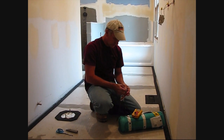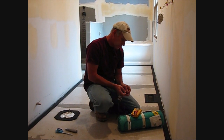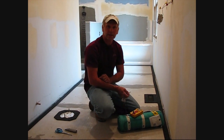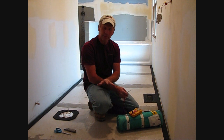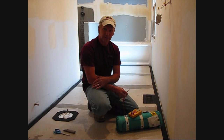We're going to be doing three resistance tests. The first one is right here before we actually move the mat — it's 14.9 ohms, and it absolutely says 14.9 right on our mat. We're going to put that in our manual and take two other readings: one right after we've had it all spread out, and the second one after our self-leveler. At that point there's no way there could be any damage to this mat at the tile stage.